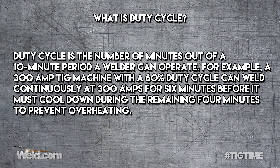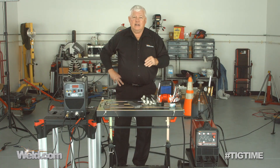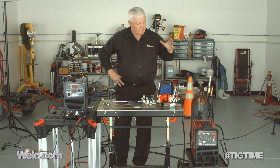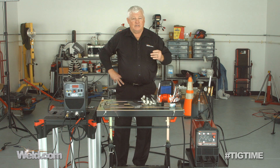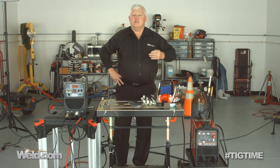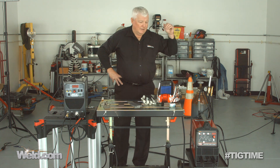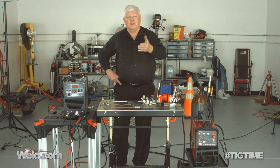So this machine right here, it's called a V205. It's an AC/DC machine made by Lincoln Electric. Fantastic machine, no longer available. The price tag last time I checked was about $3,900. So if you're into full time business, you want an industrial machine. But if you happen to be the guy in his shop doing hot rods, building a chopper, or fixing aircraft, everything is relatively light duty. You don't need the full 205 amps at 60% duty cycle — you need something lighter.